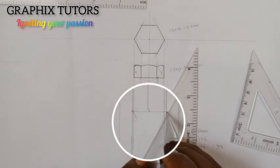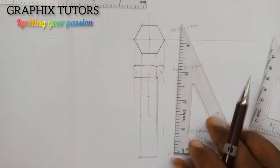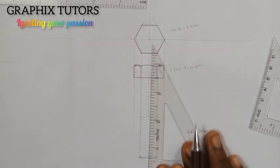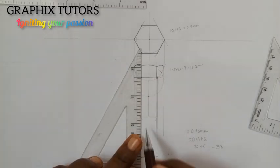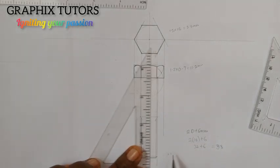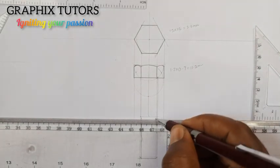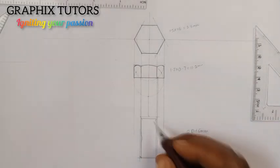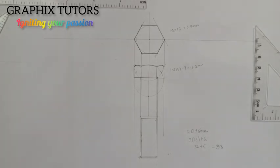This way, which is the 60 degrees square. Now I will move it from this point where it meets here, and I'll just draw my line upward for that 60 degrees. Move it to this point also, then I'll come here and use the front line because we are told this is a bolt and a nut, so it's a front line here. The threading is at this point — this is how far the thread can go.